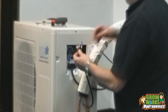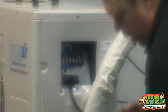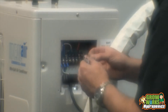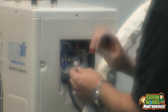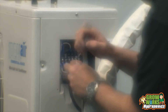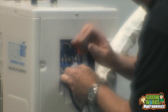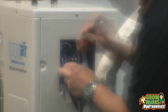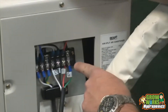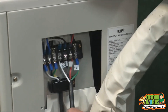Take the control wires that are color-coded and numbered. You'll come up inside the outdoor unit panel. The grounding lug is the only one you have to completely remove from the unit. Number one is red to red, black is L2 so go black to black, and white to white which is L1. Your electrical components are hooked up. As you can see, it's easily numbered with color-coded wires — red to red, black to black, white to white. It's very simple and very hard to make a mistake.